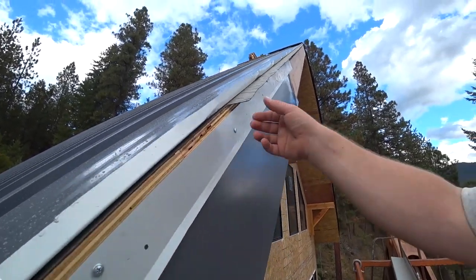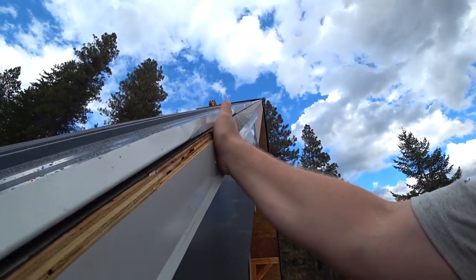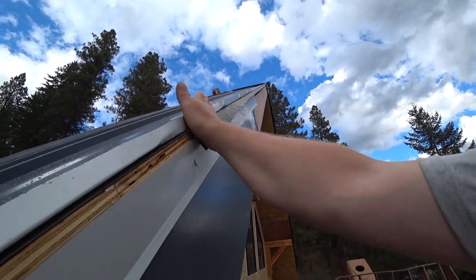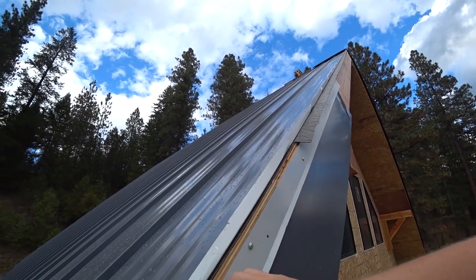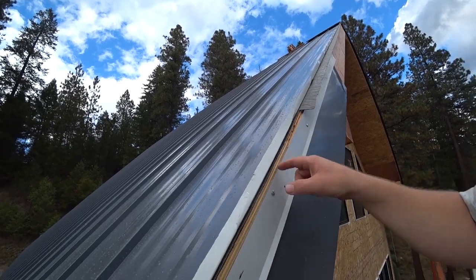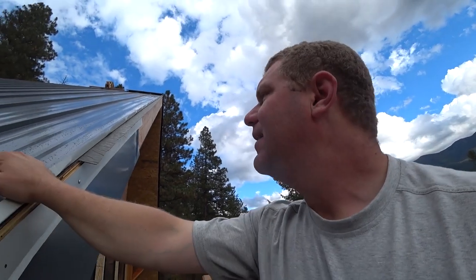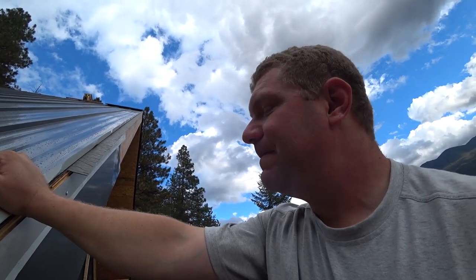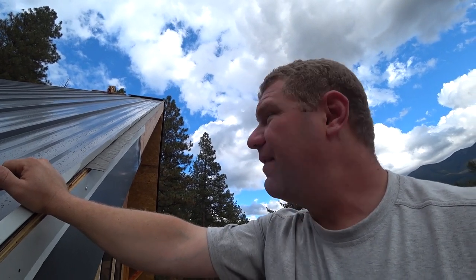And then actually the membrane here, which I knew would be an issue, my plan was always to tuck that down underneath the cleat to keep that continuous. But in the interest of trying to get this done, I decided just to cut this part off just for testing's sake. And sure enough, that was definitely impeding the step rake from working. So lots of discovery right now.